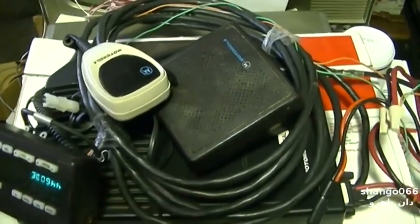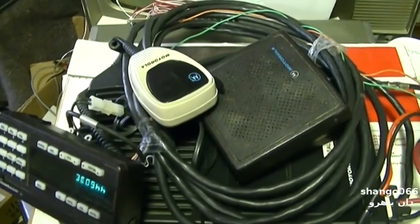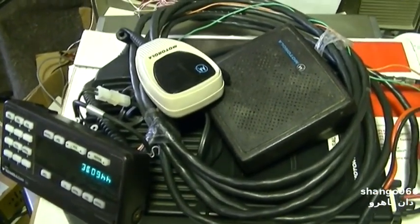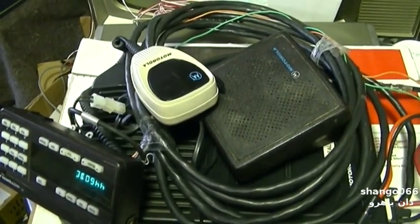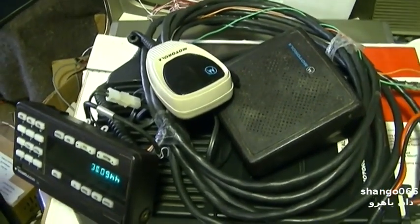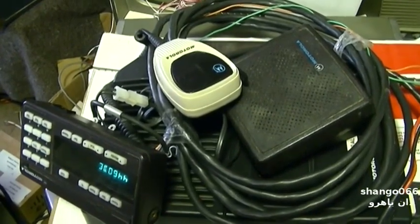The sensitivity is not great. They're really good performing radios — this is the UHF model, basically 450 to 470 megahertz, although it will drop down to 440. I've modified it so it works down that low, but the sensitivity really drops off even more below 450.